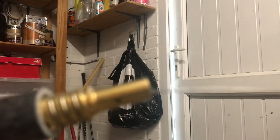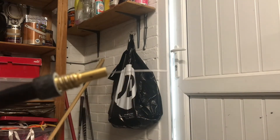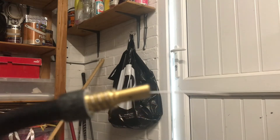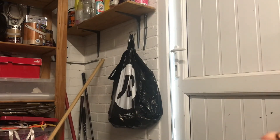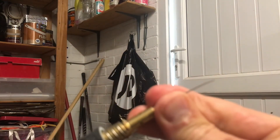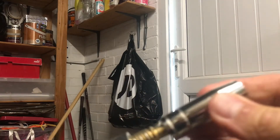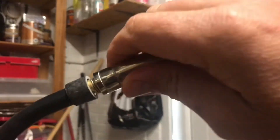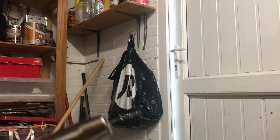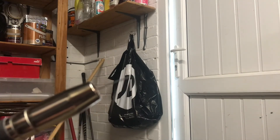So I'm going to turn the machine off now, put the cup back on. I'm going to put the nozzle end back on — this is the one it came with — and tighten that up, then put the cup back on. And then just cut the wire end off a little bit. And that's me fed the wire through.